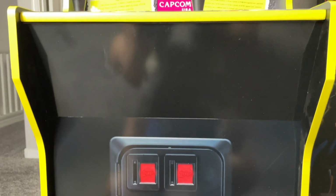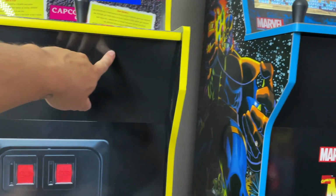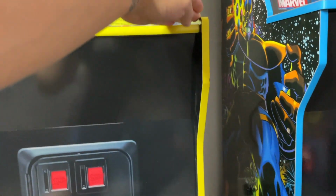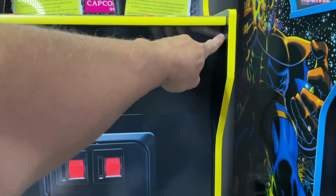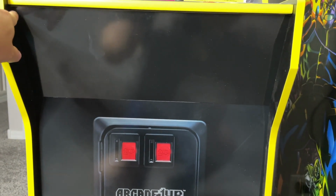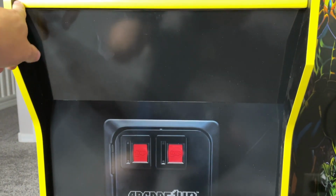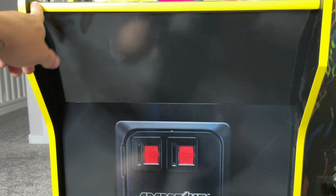Keep in mind too, if you do decide to go that route, that unlike your earlier edition cabinets, the groove for these is not a slot that allows you to drop it in. It's instead a pre-cut slot for this size. So you're gonna have to route out a bigger hole or notch out your piece here that you replace it with so that it fits there, but still extends the rest of the way underneath the control panel.